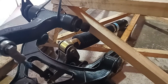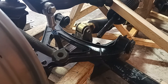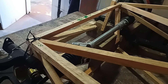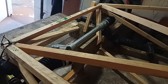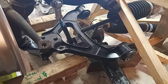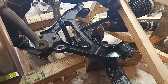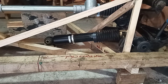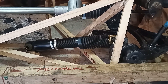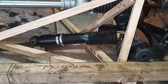There's a lot going on in this area, so it's very dense with mechanical components. There's a lot of competition for space between the mechanical components at the front of the vehicle. The steering rack is roughly positioned where it needs to go — I'll have to lift the front of the frame up slightly in order to give the steering rack room to breathe. The steering rack will also need a significant extension in order to reach the steering arms from the Metro hubs; this car is a little bit wider than a standard Mini. Stepping back, despite the binding on the wooden frame, there's actually plenty of clearance around the mechanical components, and all of the triangulation at the front means I haven't compromised the integrity of the space frame.